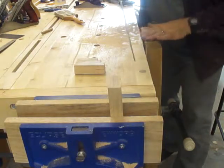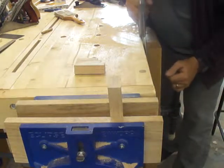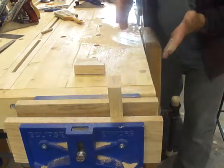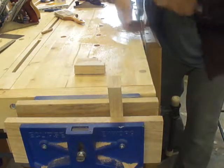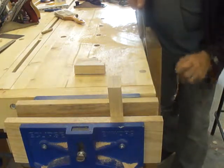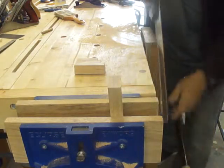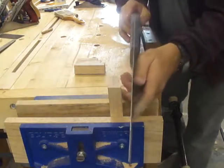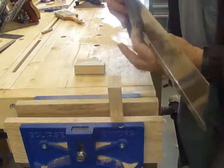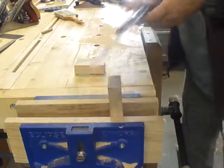You can take any vise. This vise happens to have leather jaws. Put it in here and just begin to snug it up, but you can pull it. And the plate was curved this way, so as I pull, I'm bending up here. And it was mainly right back here, right through here. So if you could see that, just pulling it through that vise under tension, straighten this. And if you could see, this has a straight plate.